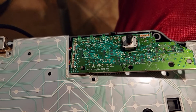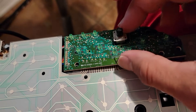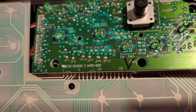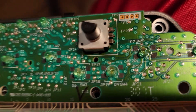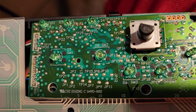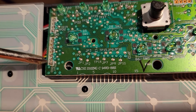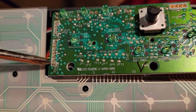On certain electronics there was a wire inside that was round, and if you put any cleaner in you'd break the wire — some are very difficult to rebuild. Looking at all these solder joints — JP1, JP2, TP14 — anywhere I see an issue I'm going to reflow the solder. You have to really know what you're doing with solder. This one looks very questionable right here. It looks like someone did something here prior, and if it's not getting a good ground that could be the problem.